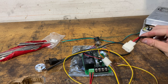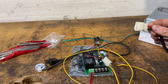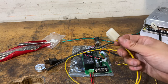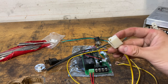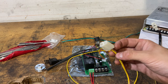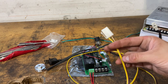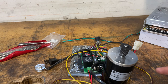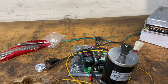About these connectors — the motor did come with a connector, but it's a standard scooter connector. I had an extra Razor scooter controller connector and the individual terminals, so I made my own little pigtail, but you can find those all over Amazon and eBay. First thing we're going to do, since we got all this stuff, is bench test everything, because I just got this in and I want to make sure everything works before I start tearing it apart.